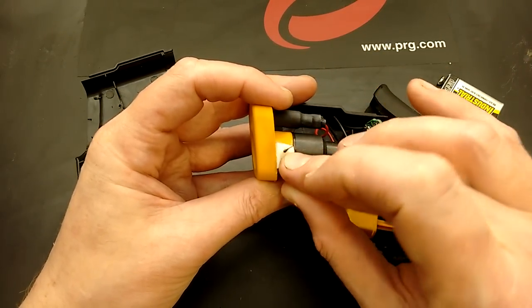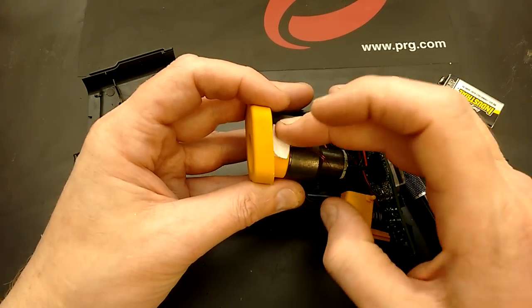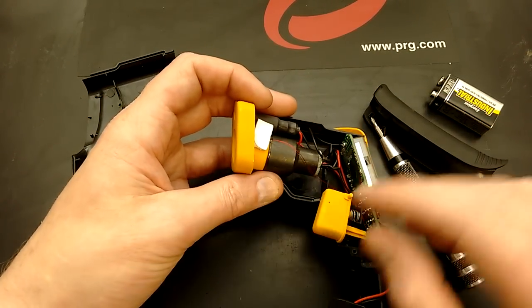Plus what I'd guess is probably going to be a little bead thermistor, just to measure the temperature of the actual sensor area itself to get an ambient temperature, and that will offset to the temperature of the device it's looking at.